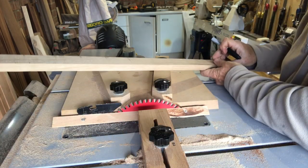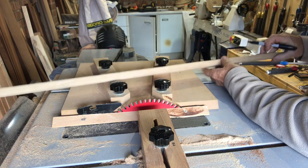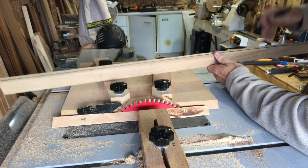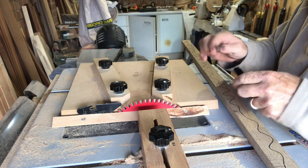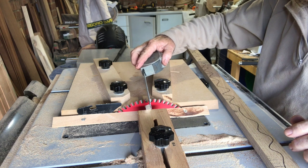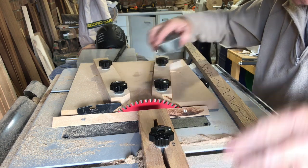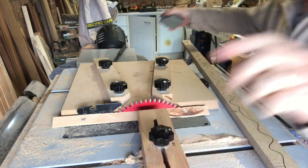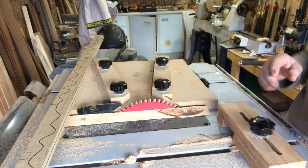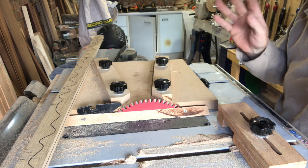As I've said in previous videos, what you must always do is have a wiggly line down one side and a straight line down the other. What we're going to do is make the 16 segment ring, and as I said earlier on, we need the segments, the length of it, 42.5 to make it up. So we will cut them off. What we'll need is 48 segments to make the 3 rings up, and in the centre one we're going to have a little slither of sapele, something like that.